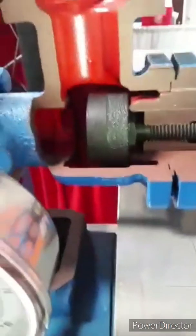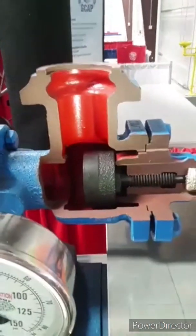If the gases get compressed, they're going to go through the discharge check valve on the top side — you might see these little holes right here, right underneath the spring. These springs are in the discharge manifold, so anything that's red right here. As that gas comes out, you'll see a big separation on the manifold body between suction — yellow — and discharge. If we're successful, we'll come out this valve right here, and that would be the discharge gas going to what would be an oil separator on this particular machine. So gases come in, the cylinder creates lower pressure, gas moves into the cylinder, we compress, and it's thrown into the discharge manifold — most likely on its way to a condenser if this is a single-stage compressor.